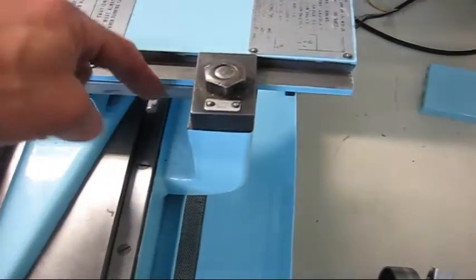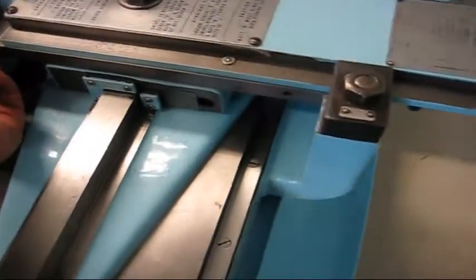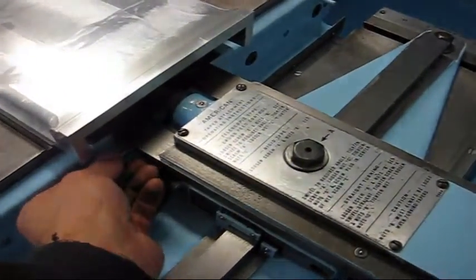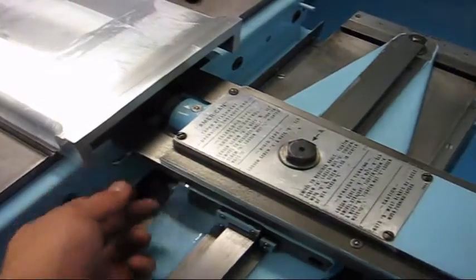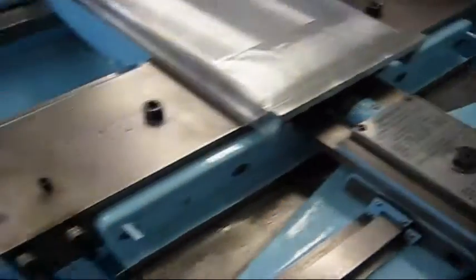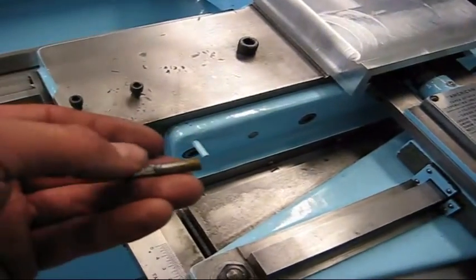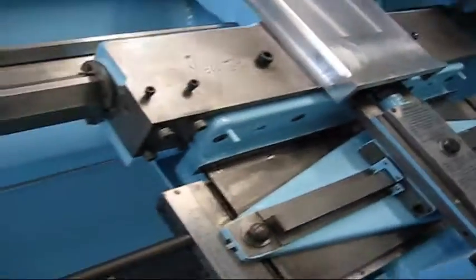I have a question about the pins. They fit in here and there are holes in the taper attachment covers that go over them, and then you put a set screw there. But the pin is really loose in all four of the holes. So I'm wondering if the pins are supposed to sit permanently in the covers and you don't have to do anything with the screws — you just put the cover with the pins in. The holes here are way too big for the pins to sit permanently; they'll just slip out. So as it is now, I will make the holes in the cover exactly a quarter of an inch and put these in and fit the grub screws or set screws permanently, and just put the cover with everything in there — if somebody doesn't have a better idea.